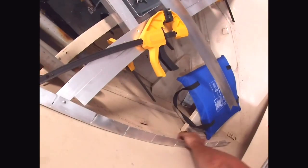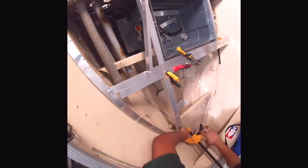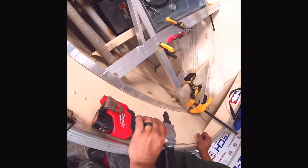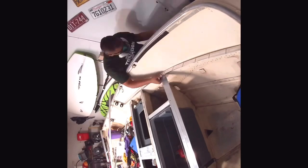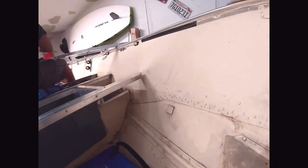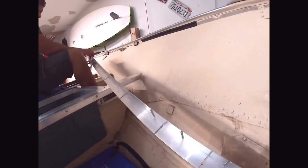Now we've got to do the side rail. If you wanted a really in-depth look at side rails and how we're going to do them, this is where you can see it. The first four feet of this boat taper up pretty dramatically — they don't actually line up with the subfloor, so you have to angle parts of your deck up slightly to make the whole thing work so your boat doesn't sag. Even at the slight taper up we still have a really high wall — close to a foot or maybe even a foot for the wall. You have to have an eye for it — don't follow the bench seats. Start from the back and work your way up so you know when it's going to start tapering and can offset it so your deck lays out straight.